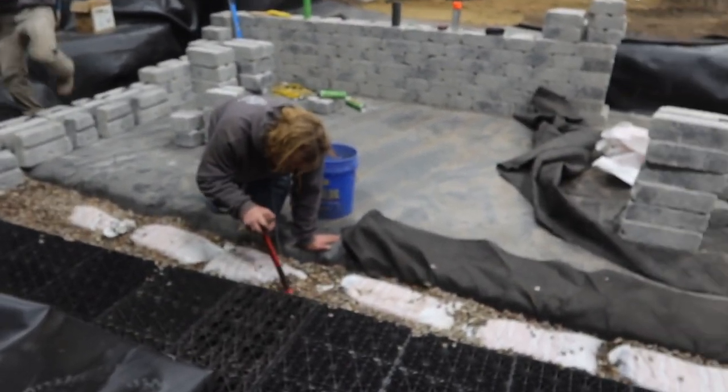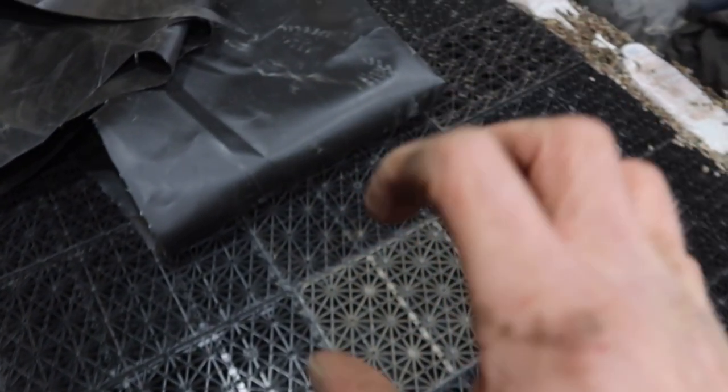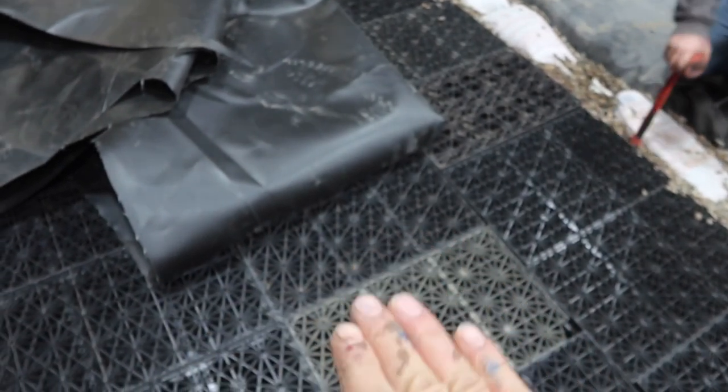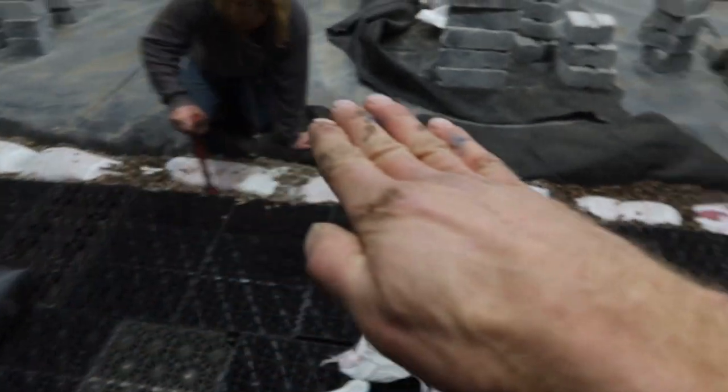We're gonna do 6x6 posts. So we've gotta lay those out. I'm gonna put a series of dots down, figure out where those 6x6 posts are gonna go, so that we can fill the aqua block with gravel so it's a nice solid base and that aqua block panel doesn't run the risk of being point loaded and crushed under the weight of the bridge. So Steve's gonna continue his way this way, get everything under compression, and we should be good.